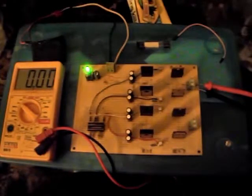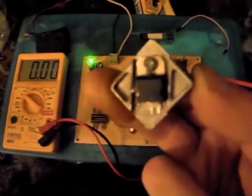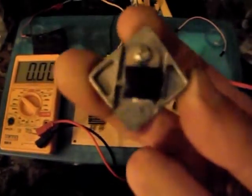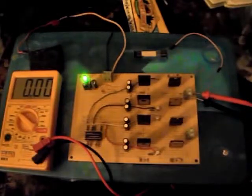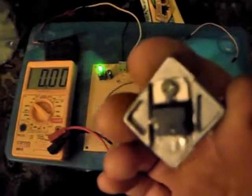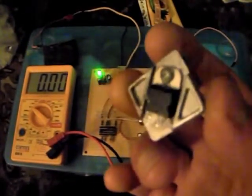Hello. Short video about what I've just made. The drills powering the walker run on these power MOSFETs. This is IR something or other, 3 amp. Obviously if you just use one of these with pulse width modulation you only get a single direction.